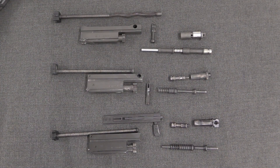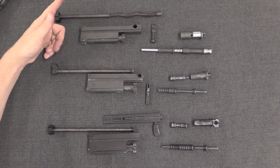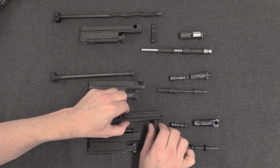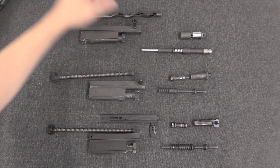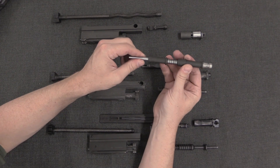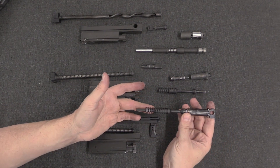With everything laid out — 805, 807, and Bren 2 — you can see how the 807 is a hybrid. The 807 has a reciprocating charging handle sitting directly in the carrier, physically attached to the bolt, whereas the Bren 2 has a separate non-reciprocating charging handle. The 805 also has a fixed charging handle. None of these parts interchange. On the gas piston: the 805 had a large diameter piston with a pre-assembled return spring, whereas the Bren 2 has a simplified, lighter three-part system that fully disassembles, with a large flag for easy adjustment between gas port settings.